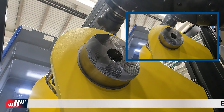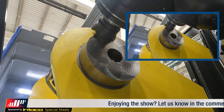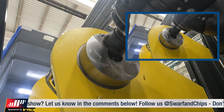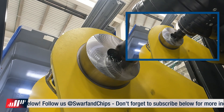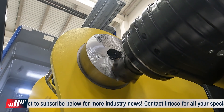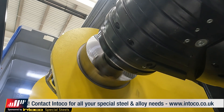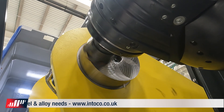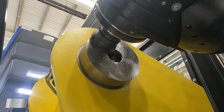You can see it on the part, and then it slows. You can hear the difference. All that is is that device magneted onto the back of the part. At the side of the machine, the operator's got a box with a switch, and they have an iPad set up constantly measuring the frequency all the time. When you turn it on — that's such a cool thing. What problems does chatter cause people? Well, chatter can cause you to scrap a part. If you get enough chatter and you're taking a light cut, you can actually take more off than you ever intended. Fantastic — chatter versus chatter.